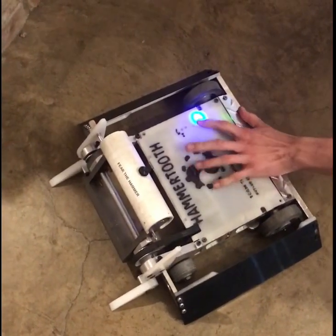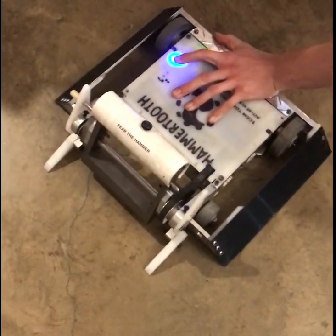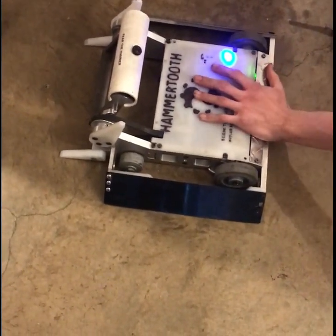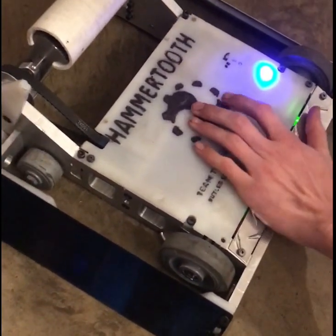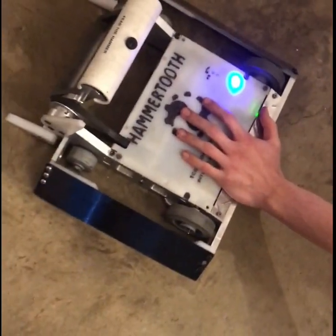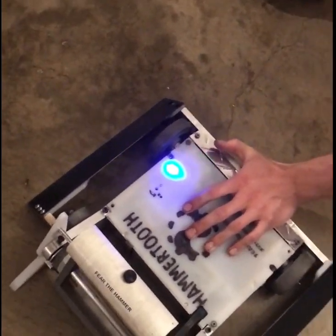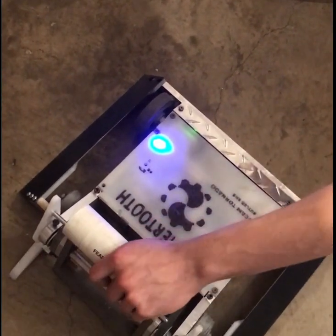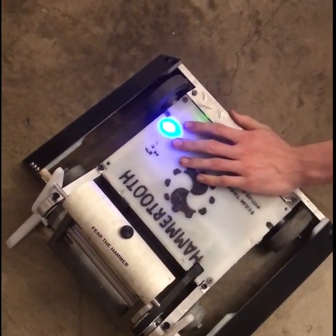You'll notice I have to push on the back of the robot in order for the wheels to make contact. We have installed strong magnets on the bottom of the robot since the arena floor we'll be fighting on is made of steel. This works out pretty well for us, but when the robot is on any other surface, such as this concrete floor, it will struggle to get the back wheels to make contact. That is because the robot is more front heavy and it tends to tip upward instead of pushing the wheels down.